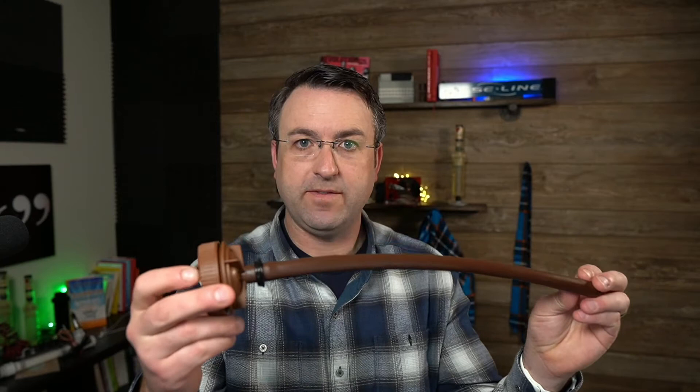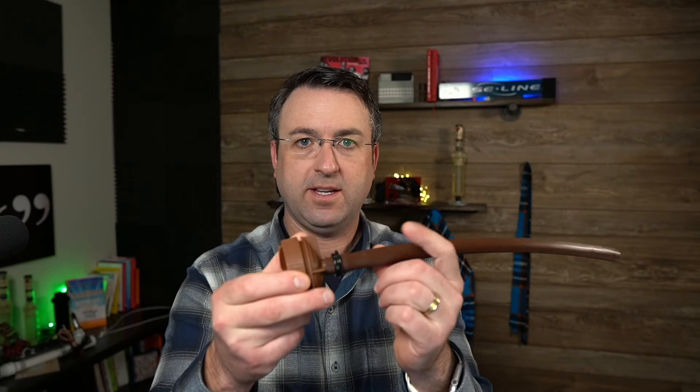I did want to point out that we have this on the TechLine CV tubing, which is the darker brown color. Every emitter in the CV product has a check valve that can hold back a certain amount of elevation or pressure — I think it might be eight or ten feet. Netafim's first tubing, called DL, is the lighter brown — kind of like milk chocolate versus dark chocolate. The DL emitters did not have check valves, so it was important to flush the zone every time the system came on, because water could back-siphon into emitters that were higher up in elevation and pull some dirt back into the system. That's the premise of the flush valve.